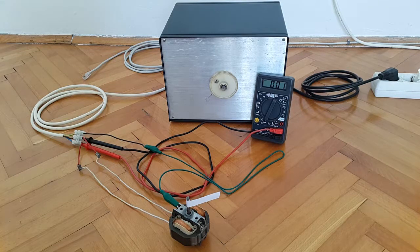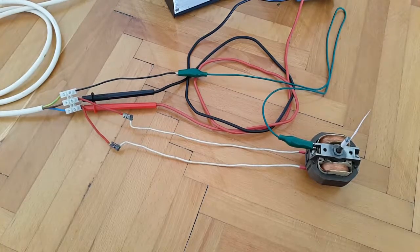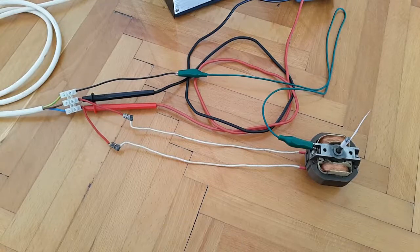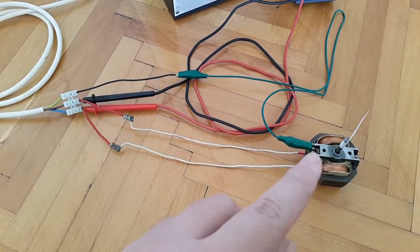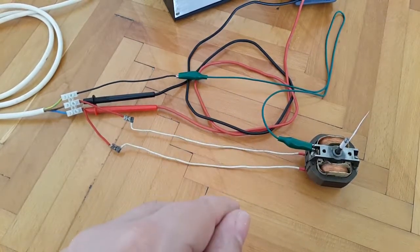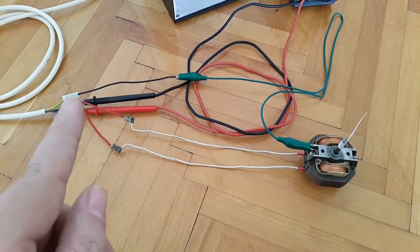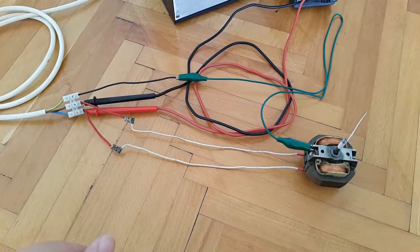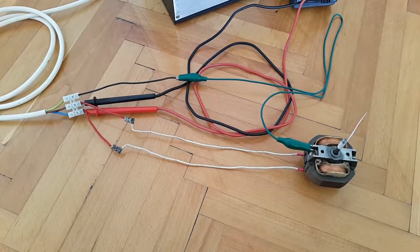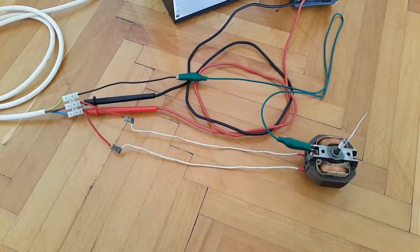So now I'm just going to move in and zoom in on the connections. This is the up close shot on the actual wiring for the purpose of this first part of the video presentation. So one end of the alligator clip has been connected onto the actual metal case of the motor, while the other side has been connected onto this black wire which is sticking out of this coupling, and on the other side is the standardized green yellow wire which indicates grounding, so this connection is securely established.